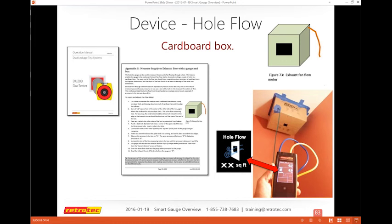Yeah, I think he's pointing out that the DG700 does not actually control the fans unless you use cruise. You can also use cruise on the DG700, which is similar to set pressure as a concept with the DM32. But in general, most people are using the speed control, which is just a knob that you're dialing up or dialing down. So the gauge is just reading those results.